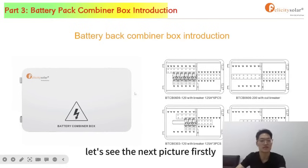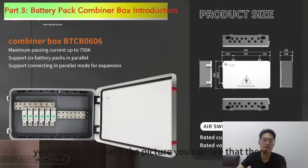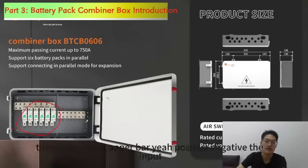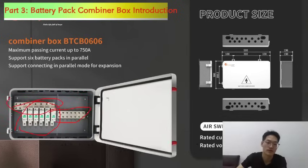Yeah, so let's see the next picture firstly. That's the picture. You can see that there are 6 air switches, and this is the copper bar. Yeah, positive, negative, the input and output. For each air switch, the rated current is huge. It is 125 ampere for each air switch, and the voltage is 80.